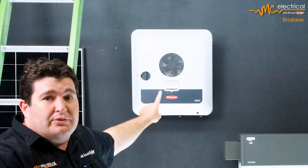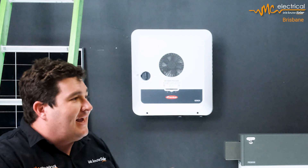It's worth turning on all your appliances to see it trip and find out what happens. The bigger exercise though is: if you've got the weekend free, see how long the battery lasts under normal load conditions with the battery fully charged — whether it lasts a day, two days, or half a day. If you've tripped the inverter multiple times and it's not restarting on its own, you can just hold the little light button in the middle of the inverter for five seconds and it'll restart automatically.